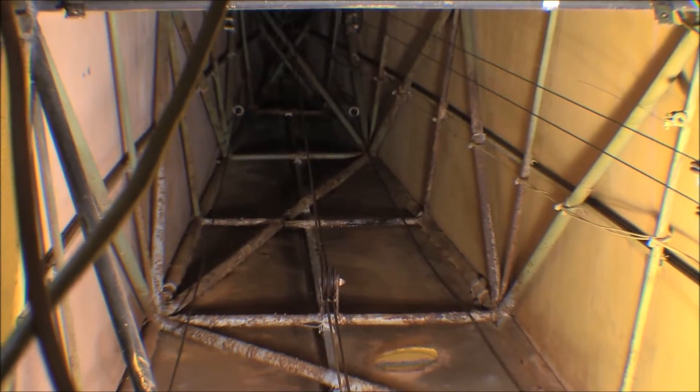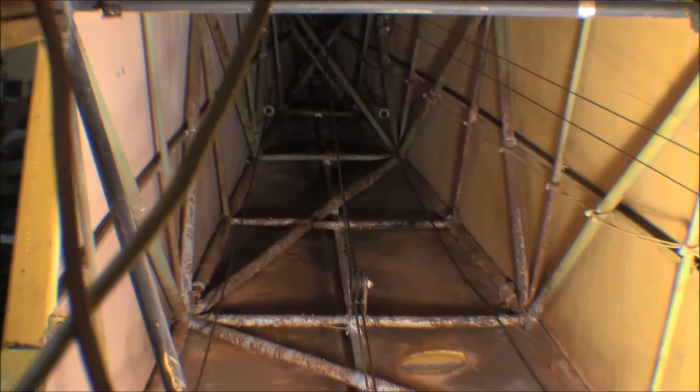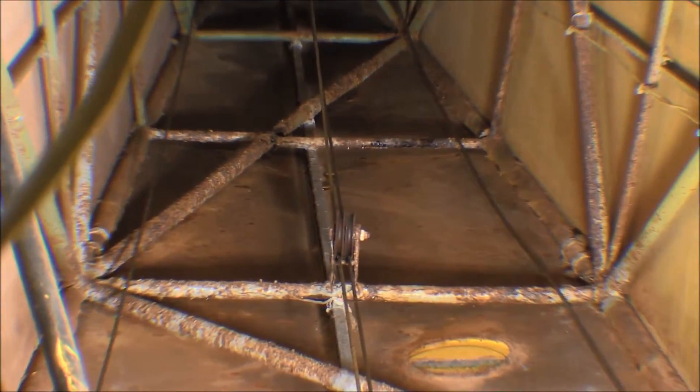I had to look in the belly there — I could see it through the inspection covers and you could see it was in kind of bad shape. It's hard to tell on the longerons because the fabric covers them up and it's kind of rusty and dirty looking anyway. But you can see some pitting, some swelling underneath the fabric in places. In those cross diagonal members and cross members they're definitely pretty bad, and you get all the way back into the back there and it just gets worse, especially on the lower ones. The upper longerons and upper cross members aren't quite as bad but they're still pretty rusty. Down underneath the tower it's hard to say how bad it is until you get back there and start poking around. Maybe sandblast it and get it cleaned up, but it's pretty nasty.